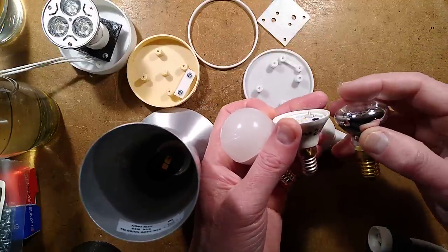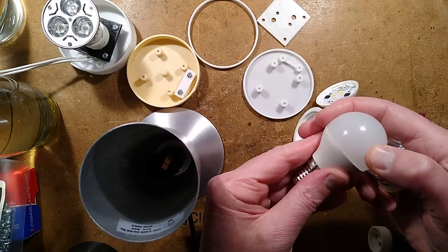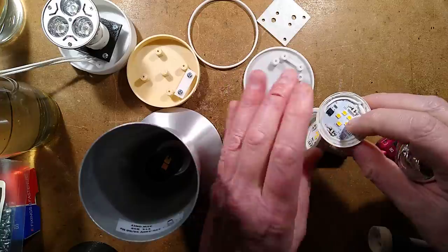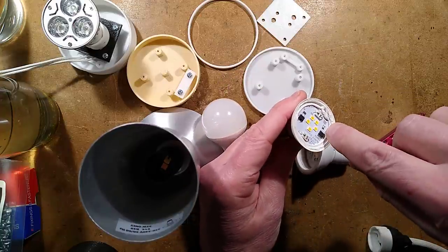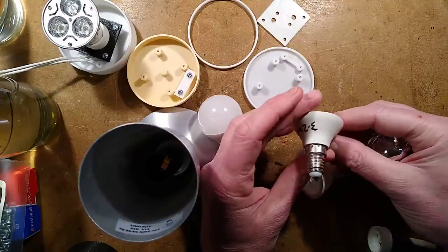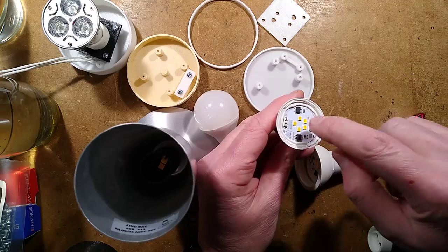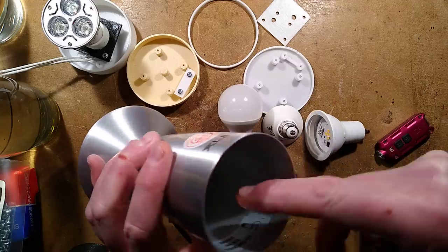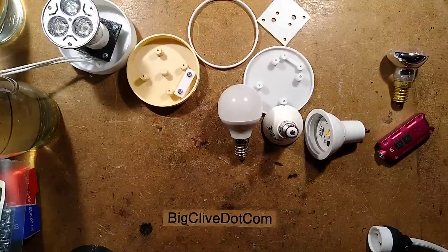that liquid jar. In this case, I broke the plastic cap off the end of one of these lamps, and it is 5.5 watt. I reduced it down in power to about 3 watts just by chopping one of the little current setting resistors found on this style of lamp, to reduce it to 3.2 watts. Things worthy of note when you do that, you're exposing live connections, and it means if someone took the bottle out and poked their finger down inside, they could potentially touch live connections. Not necessarily a good thing.